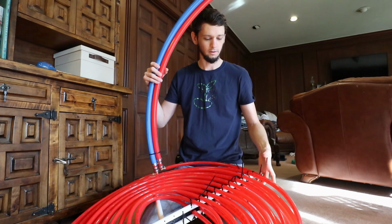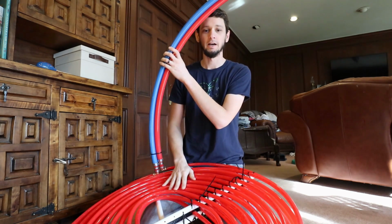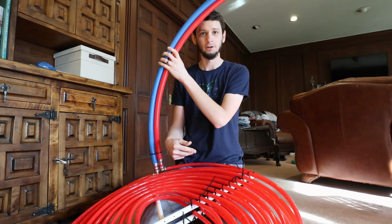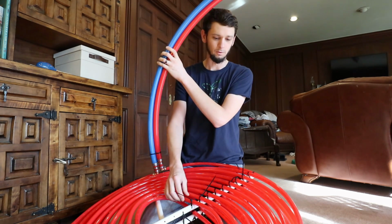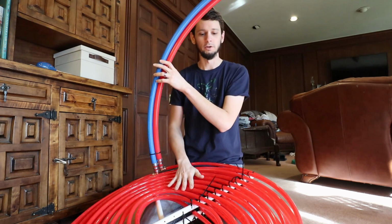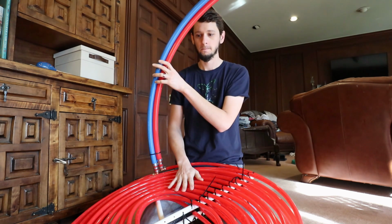6 inches deep worth of cooling tubes, and we'll be able to get a real test, because this will be about 300 feet worth of 1/2-inch PEX that I'll be able to run antifreeze through, where my previous proof of concept only had about 50 feet worth of hose, and it was a rubber hose, which may be more insulating value than PEX. So this will allow me to create the ice faster and probably more efficiently.